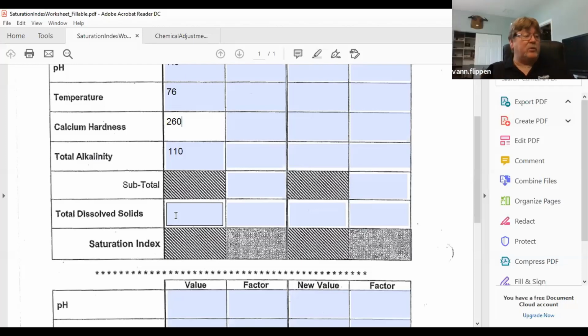So if you filled that pool with city water, that's what the TDS is. And city water is never going to be 0 TDS. It varies from state to state, municipality to municipality. But for the most part, Florida's got the worst total dissolved solids. They'll run 300 to 350. Whereas if you go to Hank's area, Michelle's, Birmingham, Alabama has some of the softer water in the United States, and theirs runs 200 to 250. So if I look at those numbers, that's my startup value.